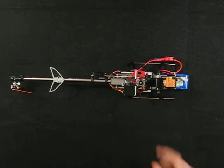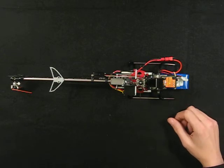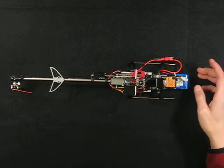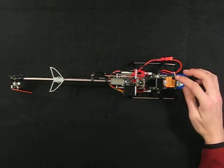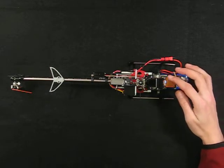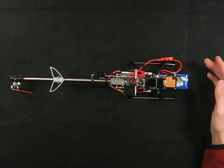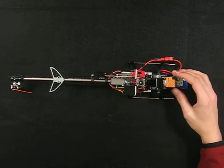We'll just go ahead and let the BeastX initialize. And after that we can go into the setup menu. Entering setup is fairly easy. We're just going to use the setup button. You can hold the setup button. When you get to the rapid flash, you can go right into the parameters menu, or you can skip over that to a solid light and get the setup menu.